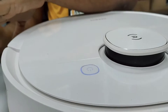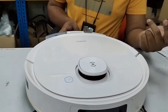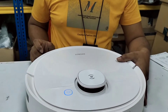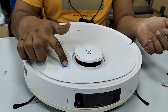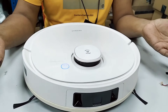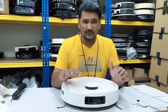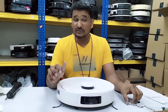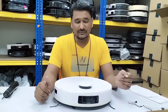Right now it is showing the white light because the Osmo Pro tank is not installed. I will install the Osmo Pro tank — you will hear the voice message 'Osmo Pro tank has been installed' and you will see the light color change. After installing, the light color has changed. When I press the button and wait a few seconds, the light stays blue — no longer going back to white. That is what the customer was complaining about: the white light remaining on when using the Osmo Pro tank.